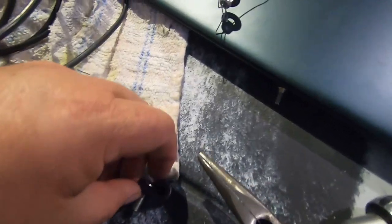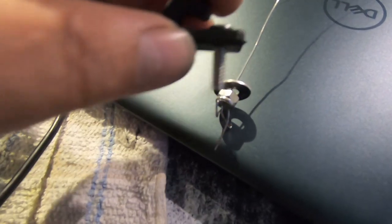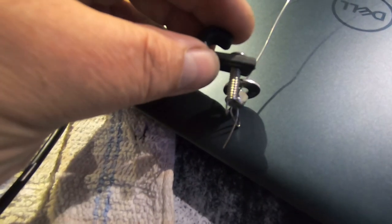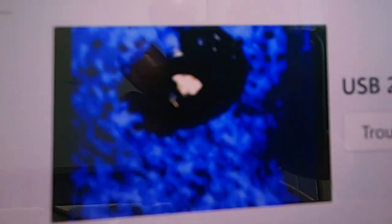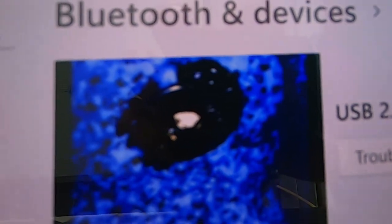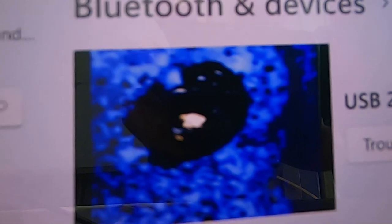And then tomorrow, all I have to do is then I'll put a different screw in this, a bit longer. And all I've got to do is then screw that into the washer and nut I've got in there. So you can see there now I've got a washer, stainless steel washer glued up underneath the hole there. So all I need to do now is put the bolt through and a lock nut on the back.